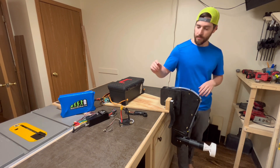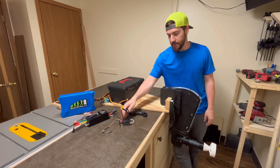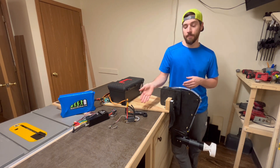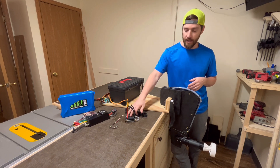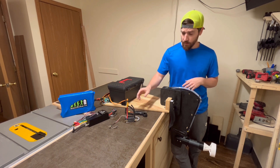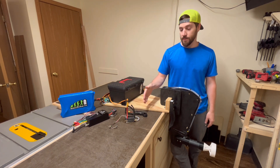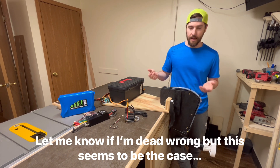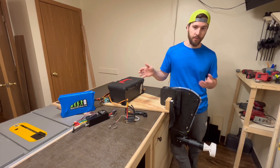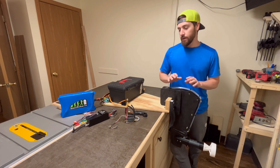This gives us a clear picture of what we can expect out of this 150-amp speed controller. What I've found out is that anytime you have an amperage rating on a speed controller, it's putting that at a certain voltage. This may be able to handle 150 amps, but that's only at a certain voltage. It's rated to handle between 2S and 6S — between 7.2 volts and about 24 volts. I'm sure at 2S, at 7.2 volts, it could push a higher amount of amperage, but as you get to a higher voltage, it can only handle a lower amperage — hence we get a maximum output of about 50 amps.